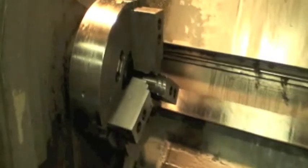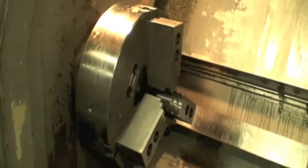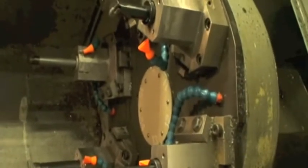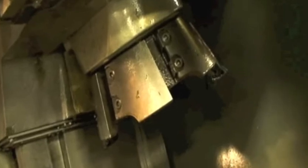It's got a Kitagawa 18-inch diameter three-jawed chuck, twin turrets, loaded with tooling. The actual cutting tools will not go with the machine, but the tool holders themselves will. It's got a second spindle, twin spindle, chip conveyor, coolant, and a swing-away tailstock, which is a nice feature.